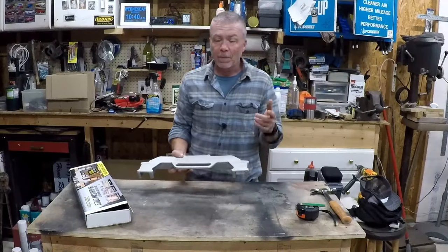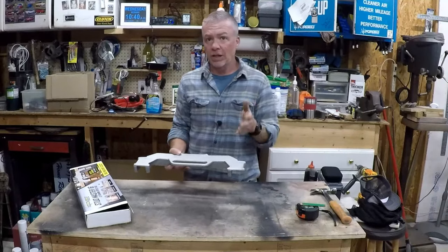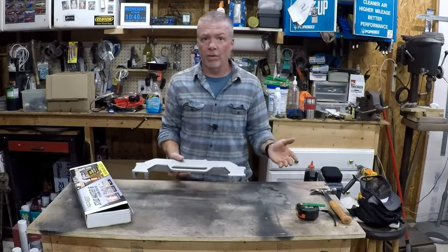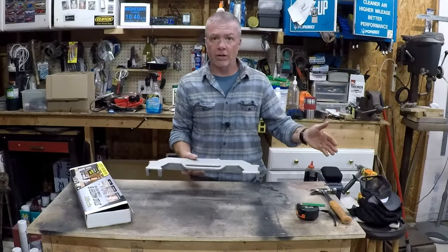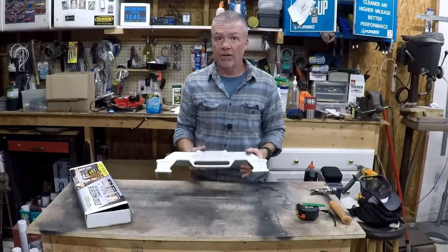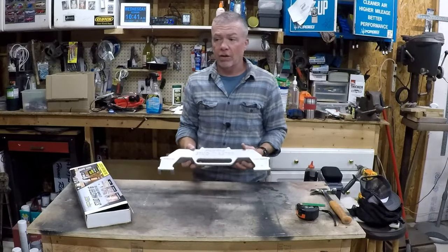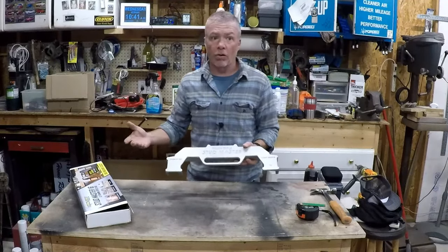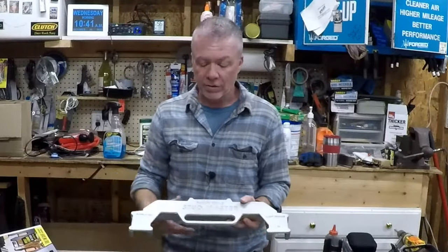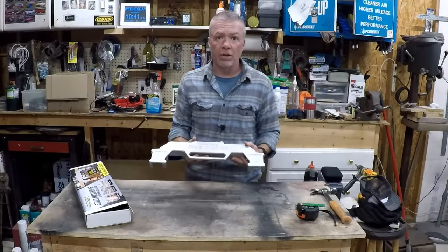I work by myself, but if I were doing interior walls and I had a helper, I could give him plate measurements, he could cut them, and then he could just use this to run studs on them, because interior walls usually don't have to worry about having that 48 or that 96 breaker for your plywood, because you're just going to run horizontal drywall usually. So in that case, could definitely be helpful. But like I said, I work by myself. But for any of you DIYers, homeowners out there who wanted to tackle something like building a shed or framing out your basement, you figure you could do it, which you can. This isn't rocket science. One of these would help if you're a little unsure of layouts. So I'd recommend it in that aspect.